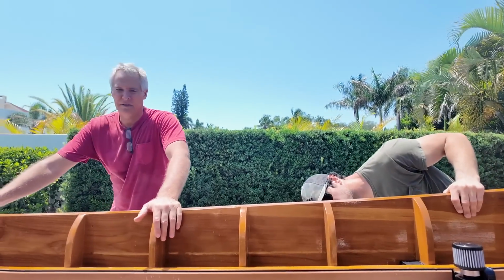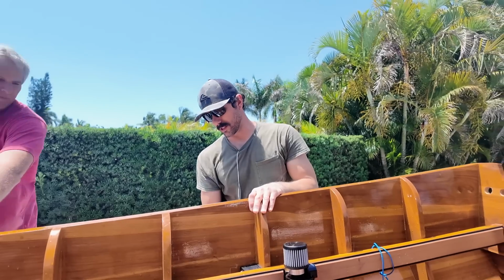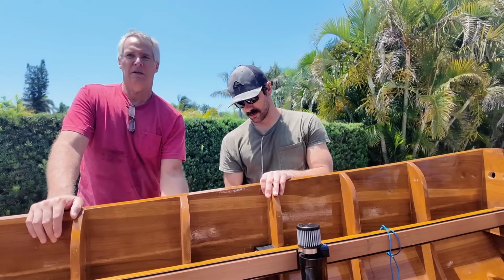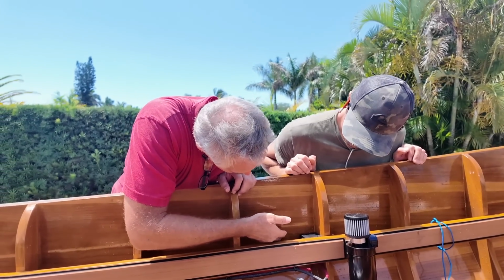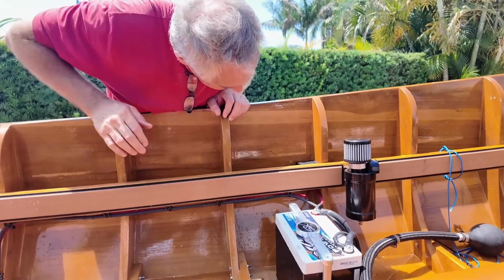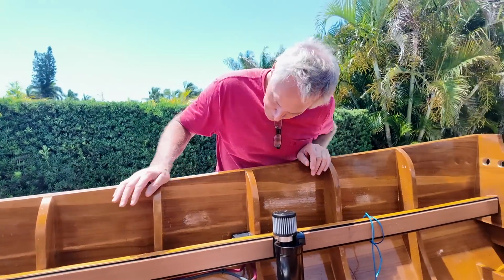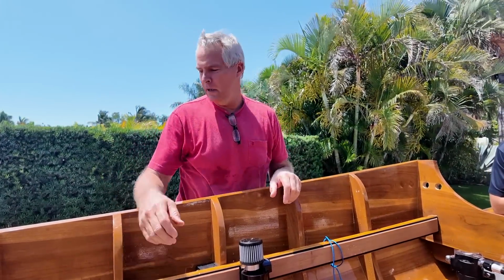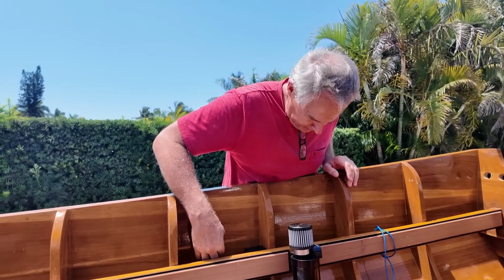Drill it on each end and stop it from extending. Well, this would probably be like some kind of an injection thing. What I was thinking was to drive wedges in from the outside, just enough space, maybe a 32nd or less, and then the right kind of epoxy matrix fix paste, and just force it in, then pull the wedges out and let it squish in and bond. Because if you can pull that off correctly, it'll be stronger than the wood.